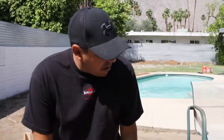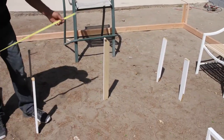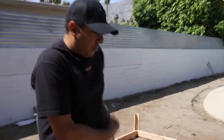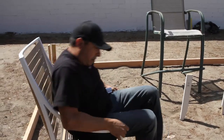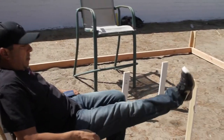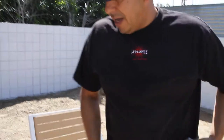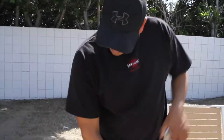Let's go over how I got to the overall width of this fire pit. I want a longer fire pit here — not round and not square — so this one is going to be about five feet by about 24 inches. The next thing you've got to determine is how much room you need from your fire pit to your chair. You don't want to be falling off the back edge, so you want to be able to put your feet up and kick back and relax. Start with your fire pit and go out from there.